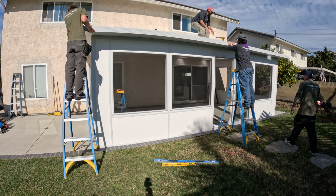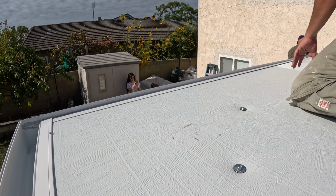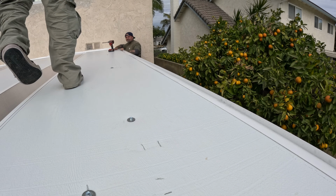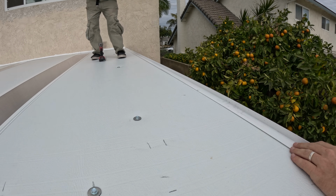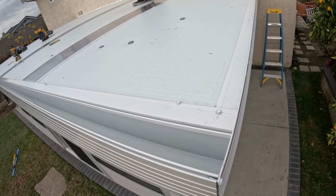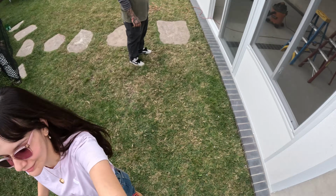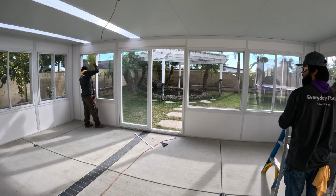And that's the gutter going on. So typically we do put the gutter on after all the electrical's done around in the roof. And you can see there we notched the side fascia to cap the side of the gutter and the side of the patio. And a couple tech screws. So those are 1/4" screws we're using, and you can see we're trying to put them close to the edge, so when we caulk that seam, we normally have a piece of cardboard we smooth it all out with. But if those small screws are by the edge, you can easily caulk them on your first run.